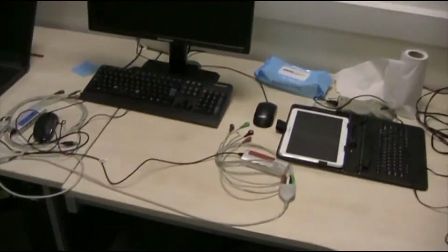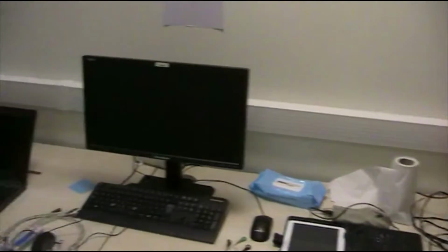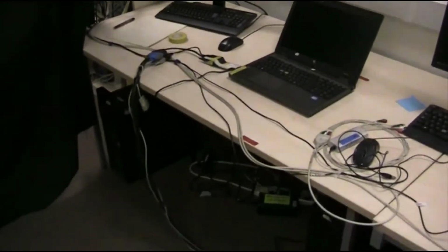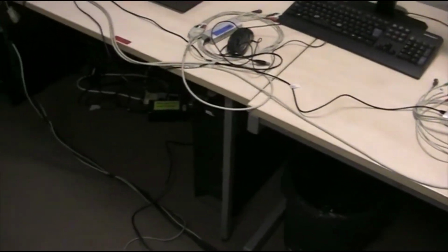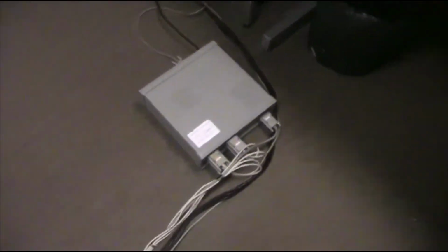Every room will have different sources of electromagnetic noise. In this room, it's the long cable guides at the back of the room that supply all the power and signals for the computers. So keep all your noisy stuff close to that, and then keep all your sensitive equipment as far away as possible, with all the cables arranged in right angles from the power lines.